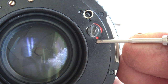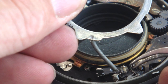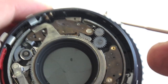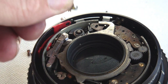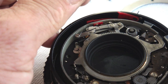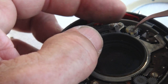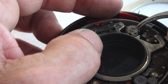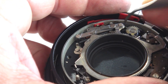The shutter needs to be in the release position and the wind pinion slot needs to be in the relation shown to the red dot before the wind rack ring is installed. Hook the spring of the wind rack ring and then seat the ring as shown. With the wind ring installed, the main wind gear can be dropped over the main wind spring so that the tab of the main wind gear rests against the main wind spring cam. The teeth of the wind ring and the main wind gear do not actually mesh but line up into position so that as the wind ring is wound by the tensioning of the shutter rack pinion, the gears engage. Here you can see the tension of the wind spring on the wind cam.